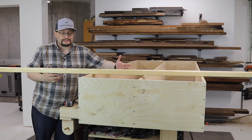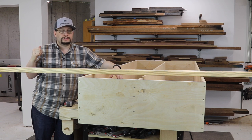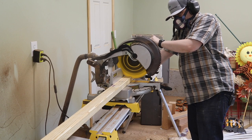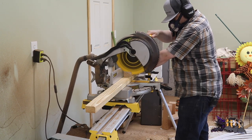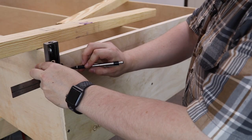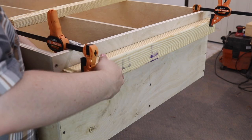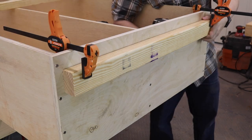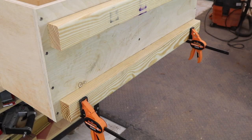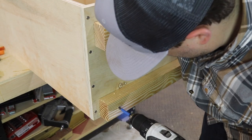Since I don't want this cabinet to be on wheels, unlike other cabinets in the shop, I've got a 2x3 piece of select pine. I'm going to cut this so it's a few inches short on each side of the 34-inch width. I'll clamp the front piece an inch and a half down from the top and an inch in from each side, then attach it from the inside with screws. Then I'll transfer my clamps to the back piece, positioned about an eighth of an inch from the back, and drill in four lag screws to use as levelers.